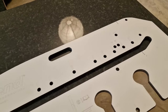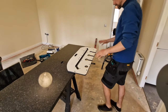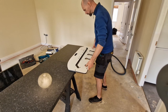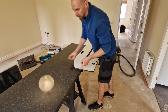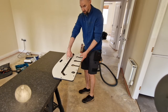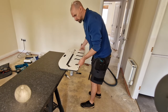Once we have those three plugs, we can lock it. Now we need to know how far to go. To know exactly where to position the template, we measure how wide our worktop is, then choose one of the options: 600, 616, 635, 650, or others. We measure the worktop and now the template won't move either way — we know the location.